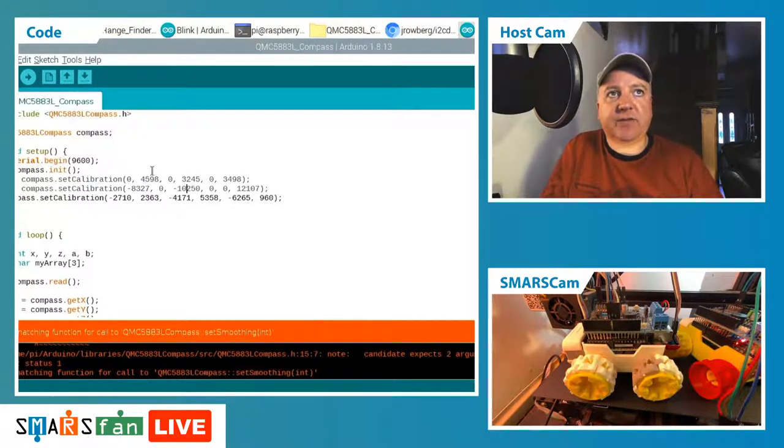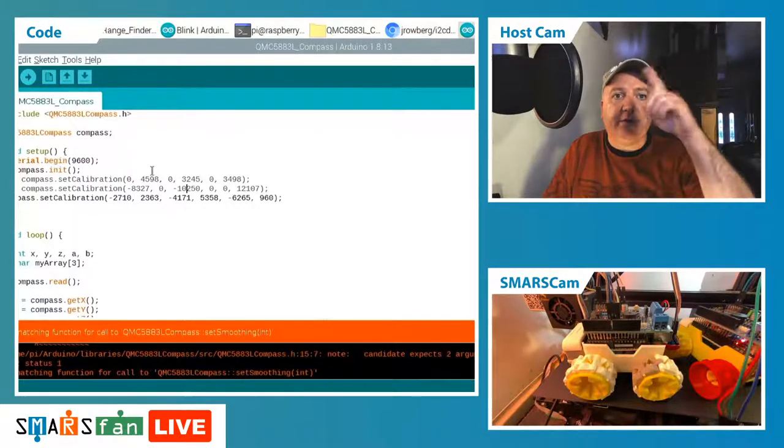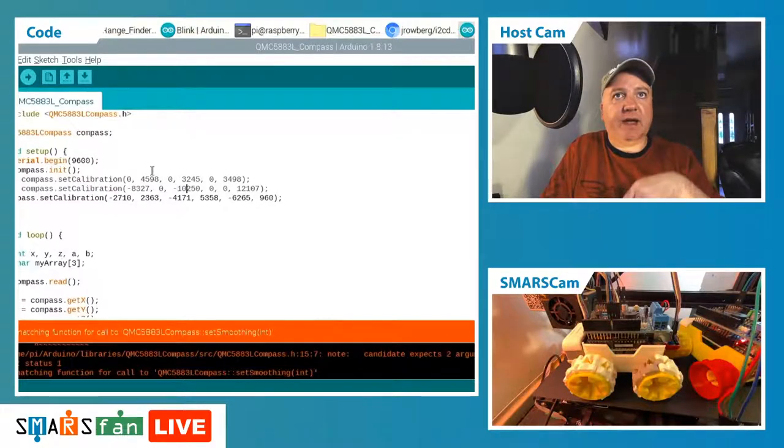And we could actually have a bit of code that looks for that to say, have you collided? Have we seen one of these spikes? Is the value from that acceleration, say, over 5,000 raw units? And if we do see that, we know that we've hit something, and we can then stop the robot as if it's just done a rangefinder object detected. We can use that as another type of object detection.